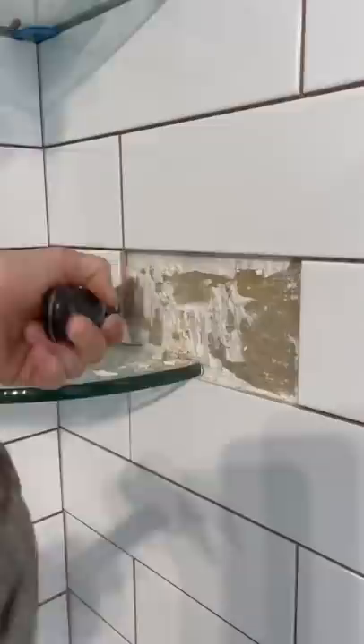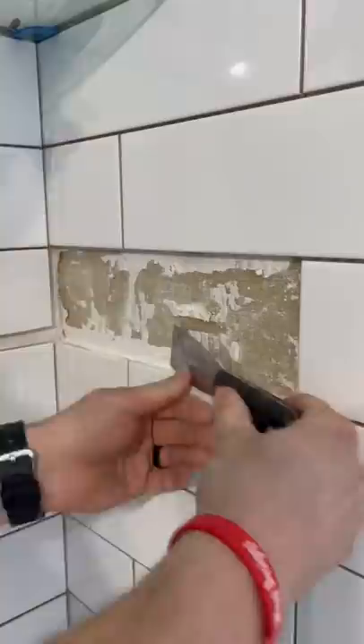The trick is to just be delicate with this — don't use a sledgehammer, just be delicate with it. Use a screwdriver, but don't puncture the shower system itself. If you do, as you can see, we have a screw hole — just patch it with waterproofing. Then you can reset the piece of tile and you have a perfect install. This is how you get more jobs, because you stand behind your work.